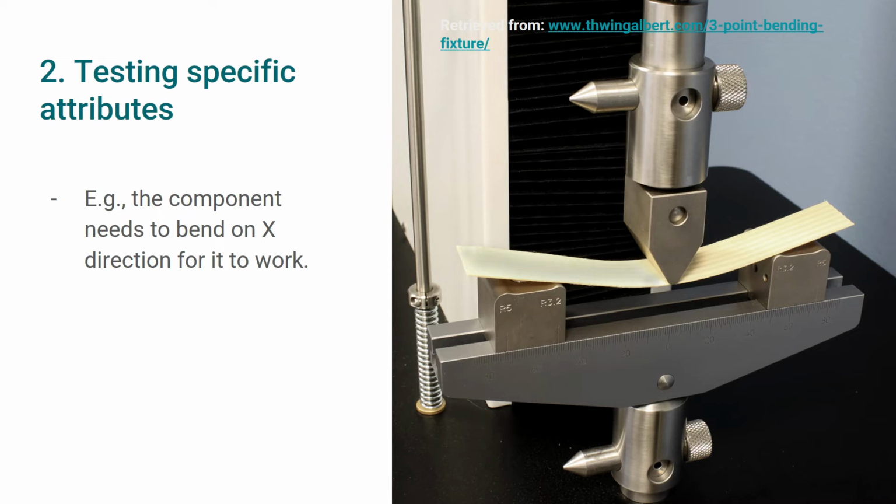The test setup on the right is done with professional equipment, but in some cases you can recreate the conditions you would like to test for with simple materials around your home or workshop. You also don't need an exact number in all cases, but an estimate of what your product can withstand. For example, if a part can withstand the force from my whole arm, it can probably withstand the force coming from my fingers.